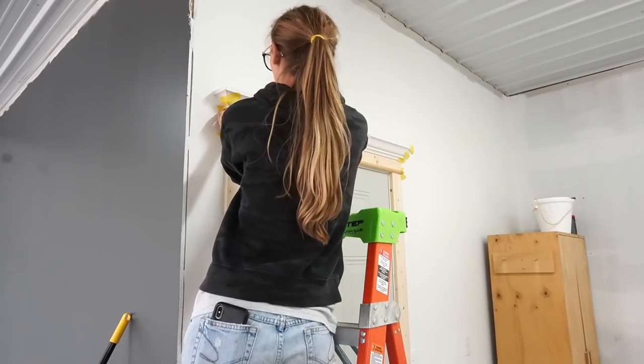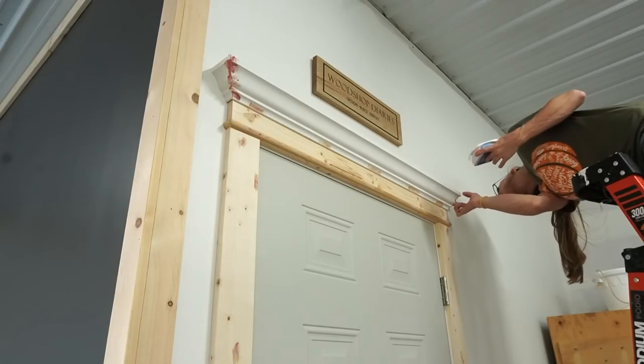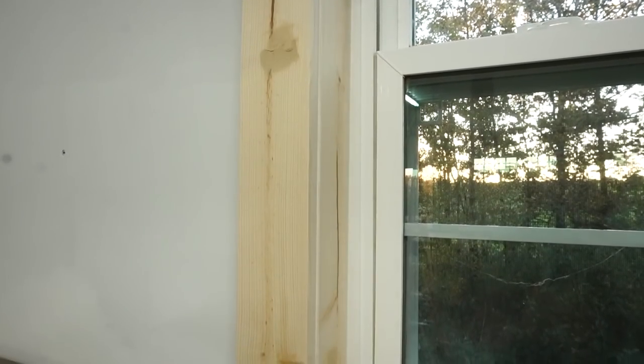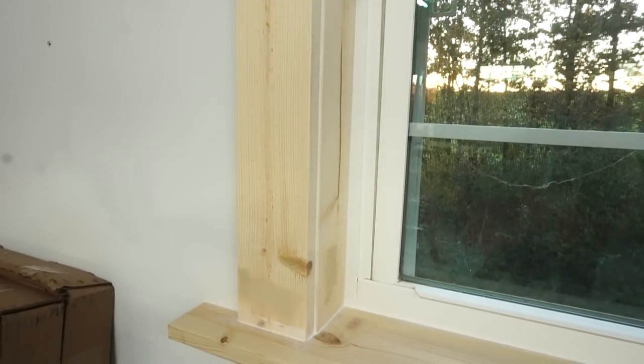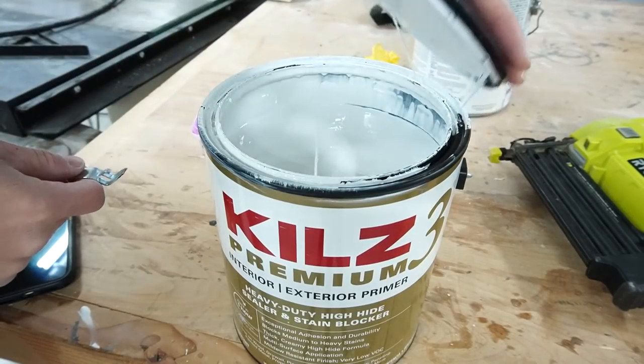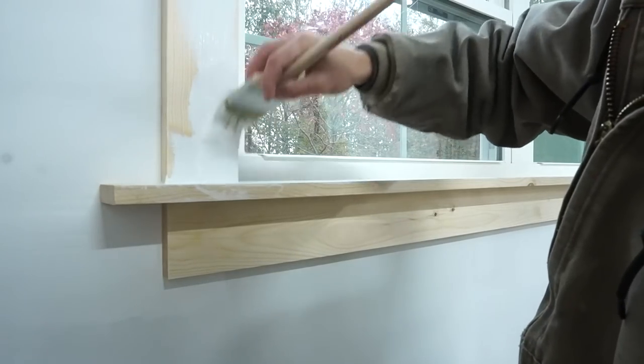After the glue dried on the trim, I went back and puttied over the nail holes and around the outside corners of the molding. Then I caulked between the drywall and the trim and between the trim and the windows. With window and door trim you've got a lot of different elements going on — I have vinyl windows and I'm butting wood up to it, and the wood is also being butted up to the sheetrock. Where different elements meet each other, it's usually best to caulk, as it seals off any gaps, makes it look seamless, and makes for a better paint job. Once the caulk was dry and putty was sanded smooth, I primed the wood — since it's raw wood, priming will make for a smoother paint coat and help better seal it. Then I applied paint and it was done.